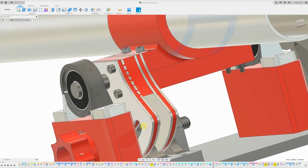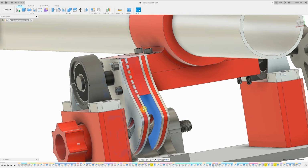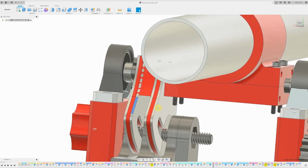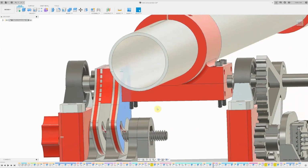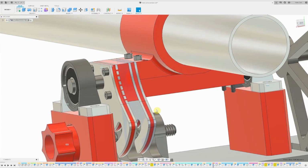I didn't want PLA on PLA for friction, so I'll cut up some old chemical bottle that's made of HDPE and glue it to the 3D printed plate so it won't wear as fast. Might have to add some grease to that if we need to during the build.